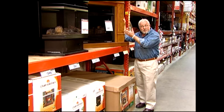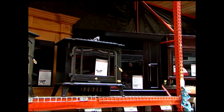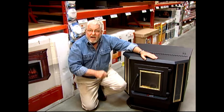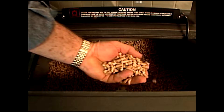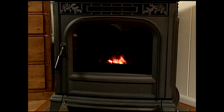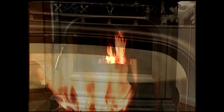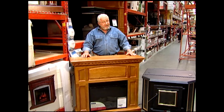Many of today's gas fireplaces come with mantles simply set in place and are vent-free. These are also available with remote controls that produce real flames and some serious heat at the touch of a button. Vent-free gas fireplaces are equipped with oxygen depletion sensors that shut down burners in an emergency. When it comes to heat output, pellet stoves are real heavyweights, putting out up to 25,000 BTUs per hour. Pellet fuel is made from compressed wood waste such as sawdust and wood chips. Many pellet stoves have thermostats and start automatically with a turn of a switch, reaching room-warming temperatures in minutes. Typical fuel costs for a heating season run around $600, and a single stove can heat as much as 2,000 square feet. Pellet, electrical, vent-free gas — three fireplace options that are clean, convenient, and economical.